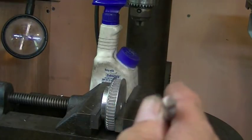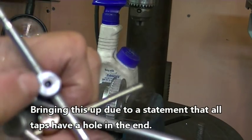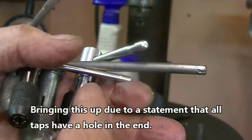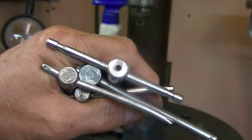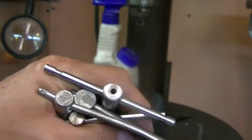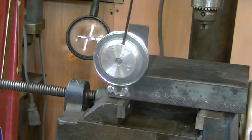This tap doesn't have a hole in the head or a cone head on it. Out of these little tap handles, there's one with a hole I could use for a guide — these are Sears Craftsman, got them a long time ago. Even with all the precautions and preparations, I ended up about a sixteenth or less off of dead center — about the width of one tap. But it still holds and it's just for testing anyway. You know how they say about the best laid plans.